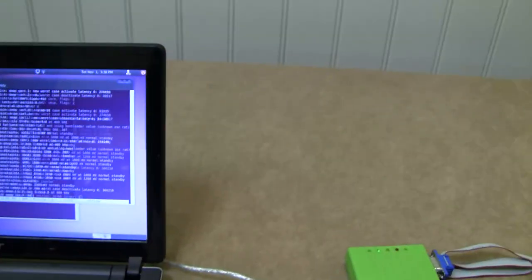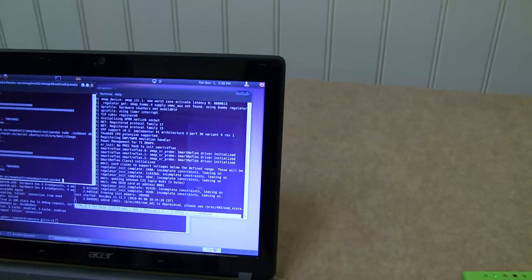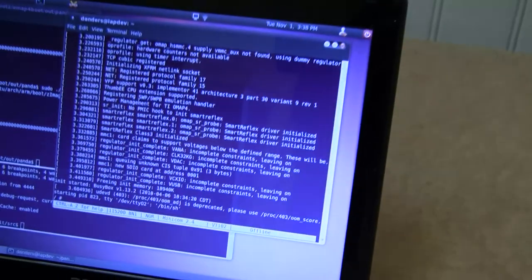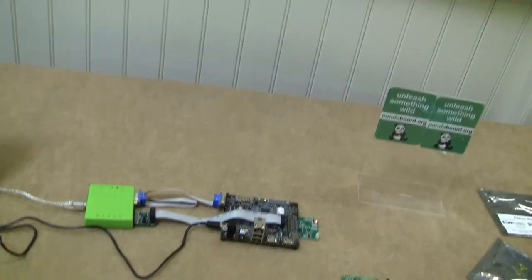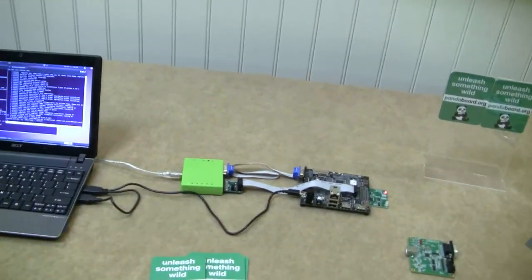Awesome, through JTAG. And as you can see in the background, I've already booted the kernel. Fantastic. Mounted the initramfs. And there you are, a prompt. Wow. So no bootloader, no ROM code? Well, it does have an aboot. Basically, it is a super, super small X-loader, a variation of U-Boot, and it's just enough to load the zImage and continue booting. Wow, that's impressive.